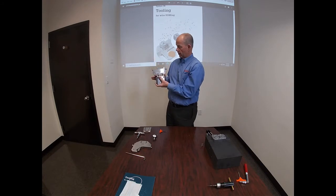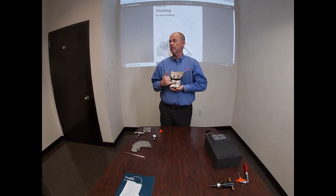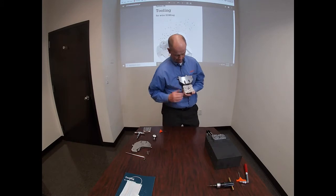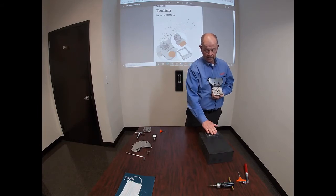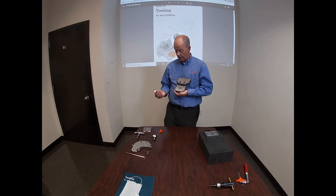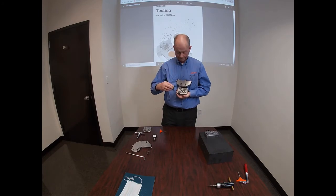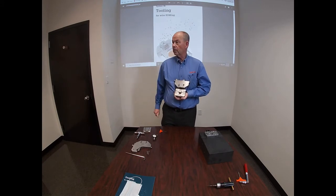We have the fixture attached to the leveling adapter, but we have no idea at this point where the fixture is in reference to the X, Y, Z references of the leveling adapter. So at this point we're going to mount the entire assembly to a chuck that is mounted true to a granite presetting station. That is done by use of a drawbar. The drawbar has four splines — it goes in, turns 45 degrees, and then the plastic locking ring goes down in place.